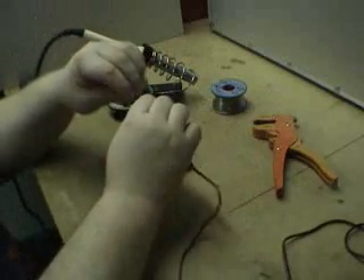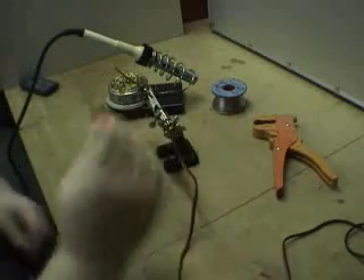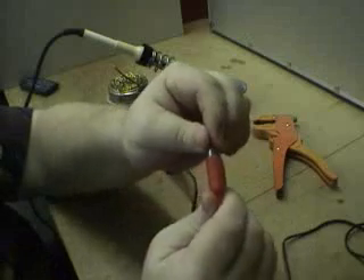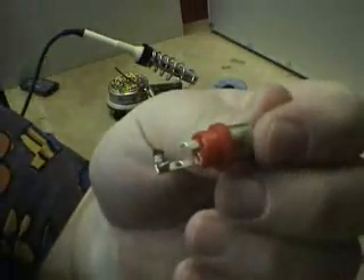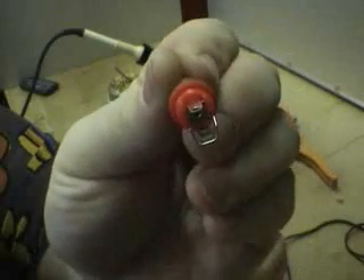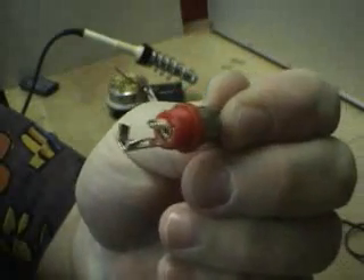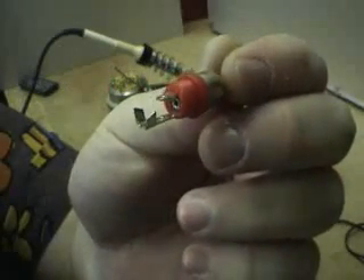The first step for soldering anything is to prepare the surfaces that you're working with. In the case of the wires, you really need to twist them so you don't get any fraying at the end, because we're going to tin the wire later with a bit of solder. We'll just rest that up here in the alligator clips — not too hard, just a gentle grip. The next thing we're going to prepare is the RCA plug. They should screw apart; they come in two parts: the cable protector and the actual RCA internals. As you can see, we have a center pin connected to the shorter of the two spades, which has a hole in it, and the outer earth shell is connected to the longer one, which also has the cable protector on it.